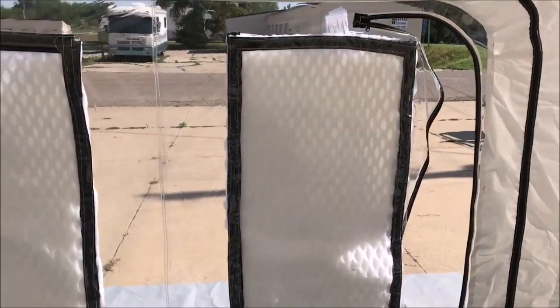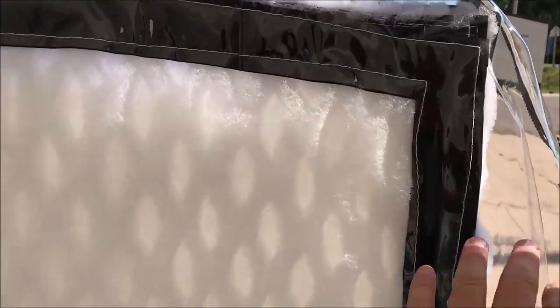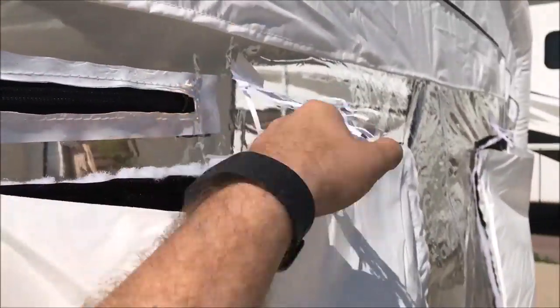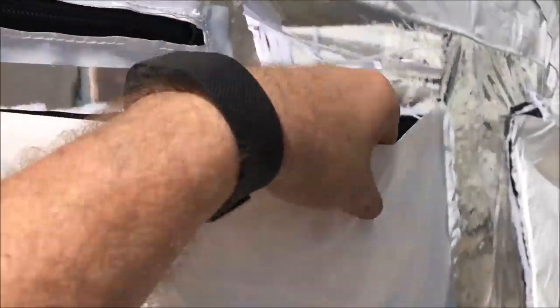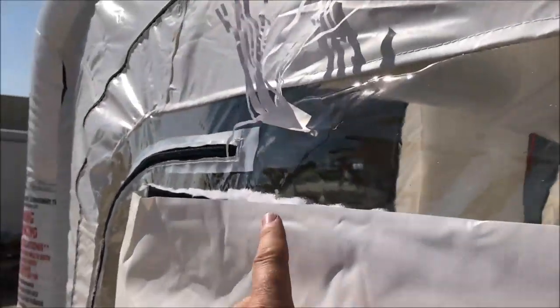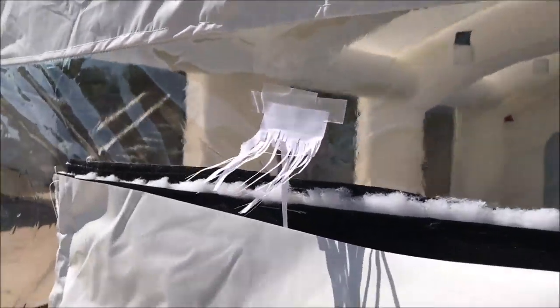Look how big these filters are on the door themselves. As that's filtered, you'll know the air is good once we close this door up. Once that door is closed and he has all those patches off, you're going to know you've got good cross flow — it's going to keep blowing up here. This is sealed on three sides and just open on the top. You can see him pulling those patches off and look at the airflow change — that's the cross flow. He only has about two-thirds of them done and it's already making that big a difference.